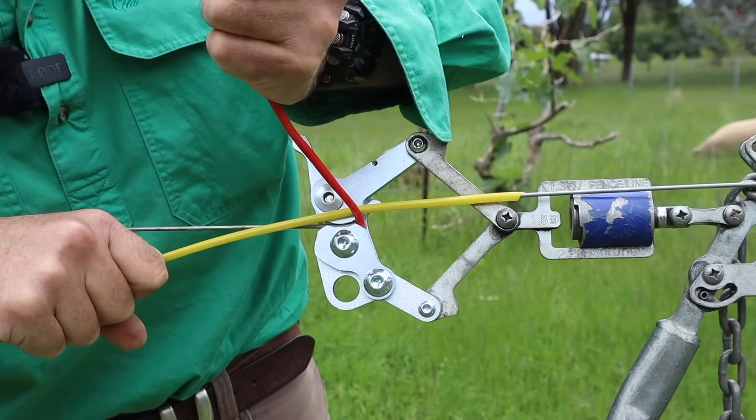Well there you go, the orange knot broke on a tight bend. Whenever you put a tight bend in wire, if you're dealing with medium or high tensile wire, it'll break there every single time. That's why we don't use things like double loops with high tensile wire anymore, because they've been found to be inferior compared to other knots.